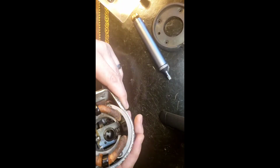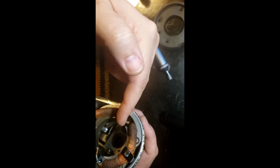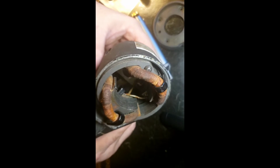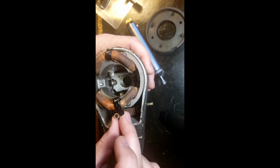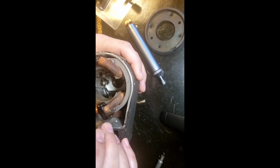There's a micro switch down in there so that when it rotates along, there's a pin in it, and when it rotates to that pin, it engages a micro switch, which I believe then reverses the motor. Now, to engage that, there is a pin that when you lower this head unit, motor housing, down to the jar, this pin here pokes down into that little hole, which also contains a micro switch. You can hear it there.